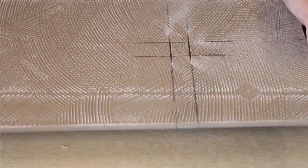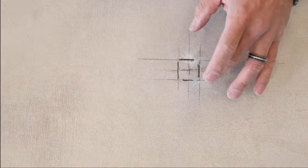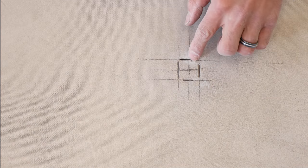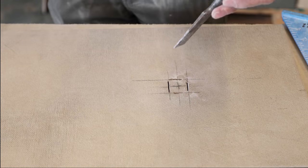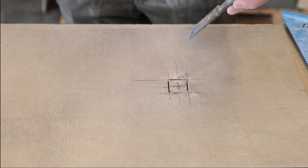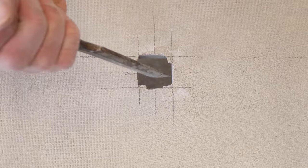I've made my cuts on the back and they've come through the front, and even though they're not all the way through on the front, that's okay. I really don't want to go past — if I go past a little bit, it's okay, but you don't have much room. Once you see it start to come through on the front, you need to stop. Now I can just take my chisel and pop it — and that little piece is going to come out. I have a few little tidbits on the side which could be cleaned up with the chisel.